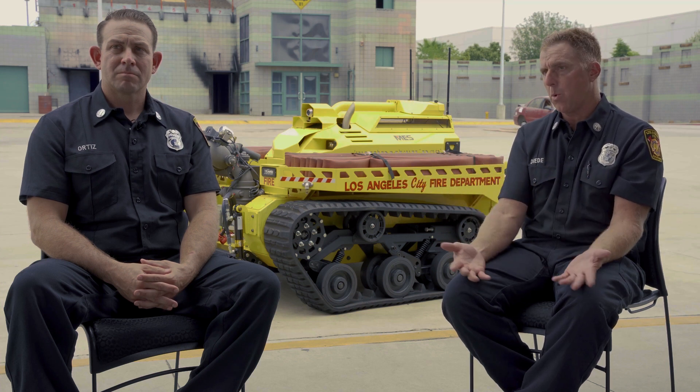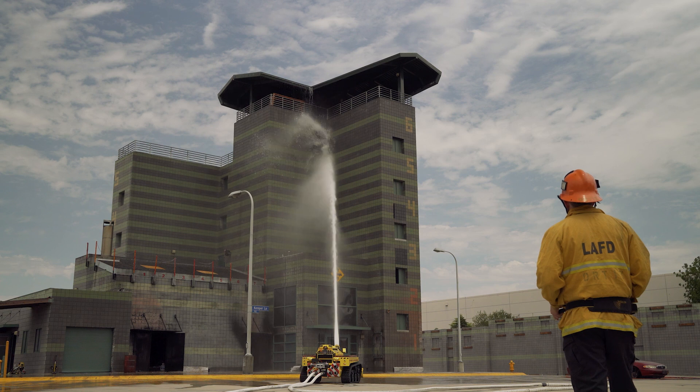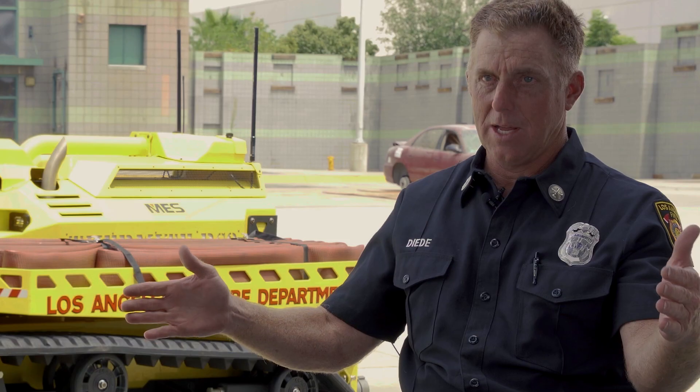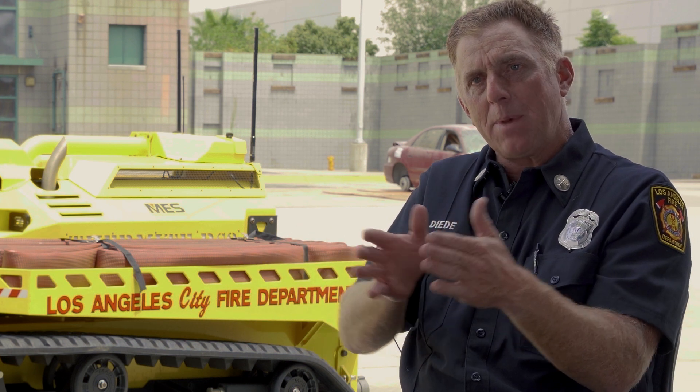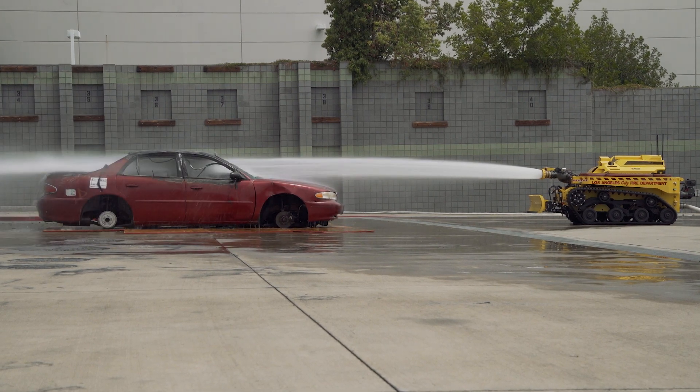Originally, everything we do is horsepower, manpower, and water on the ground. If you figure each nozzle is 200 gallons per minute and you take 2,500 gallons a minute, you can see how many people you don't necessarily have to take out of the game — that's that many more people out of harm's way. There are big fires burning with fire coming out the front of a building so hot you can't get close enough. This thing is putting 2,500 gallons a minute at face level through the windowsill — it's an impressive amount of water.